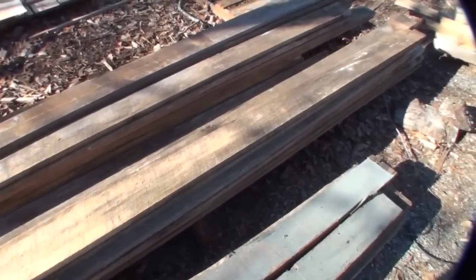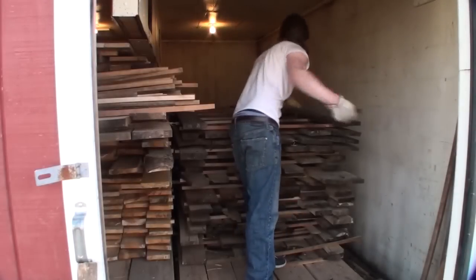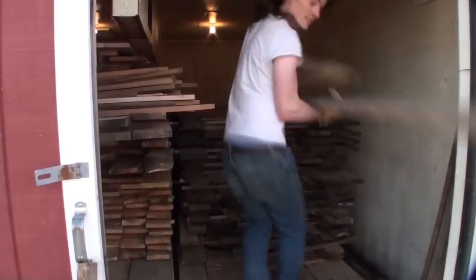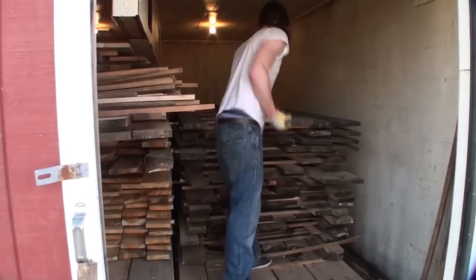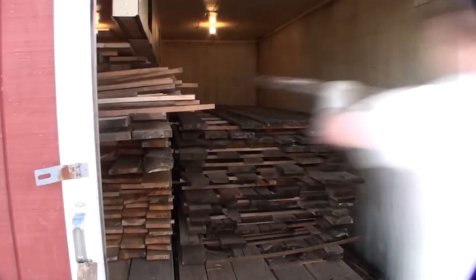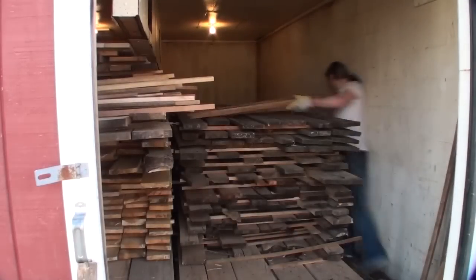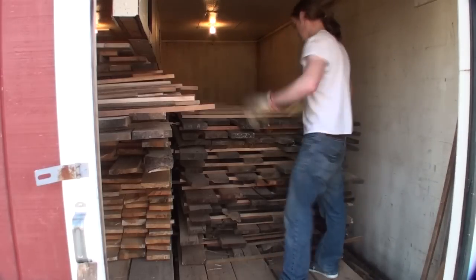Here's the wood I'm going to load up into the kiln. All the boards are laid on perpendicular strips called stickers with about a half-inch gap between each board, which allows for airflow between the boards and in between each layer. I'm going to go ahead and put the stickers in — they're placed about 16 inches apart, close enough to make sure the boards stay nice and even.